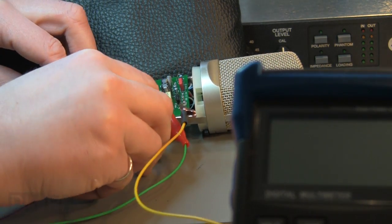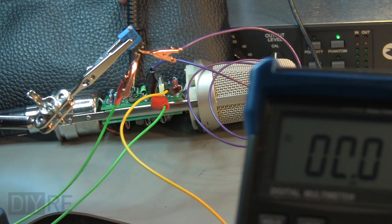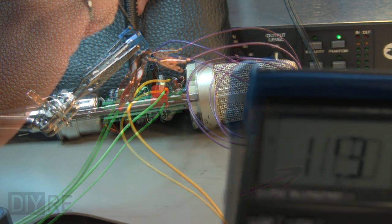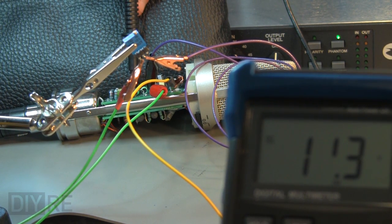The other probe of your multimeter will connect to a ground point on the PCB, and then you'll just adjust the trimmer to taste. Once you're between 11 and 11.5 volts, simply disconnect and measure the resistance that you just dialed in. At that point, you'll find a resistor that matches that value in a non-varying state.